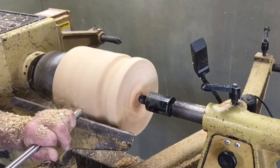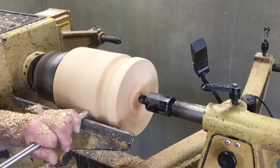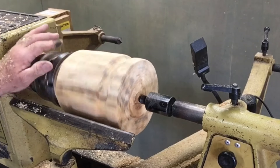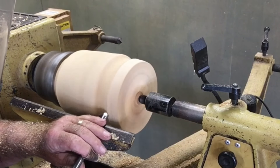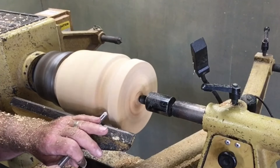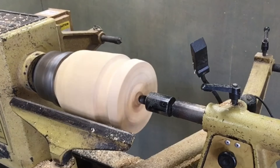As I've mentioned, this wood is really punky. I was doing a lot of scraping with different tools, and every time I stopped I was realizing how bad the tear-out was — it was just terrible. I thought maybe after it dries I can sand it a bit. But I kept shaping and thought at a future point I'd do some sanding to clean it up. Eventually I tried a small three-eighth spindle gouge and did some cuts on it. I realized it was cleaning up the tear-out really nicely — it was so soft, which made those cuts easier. So I cleaned up a lot of the tear-out with either a small bowl gouge or the spindle gouge, and it worked out fine.